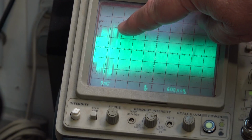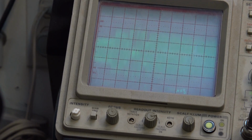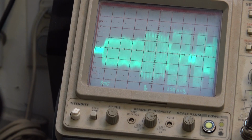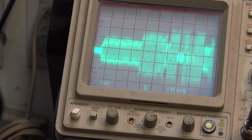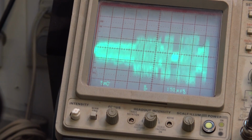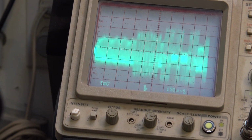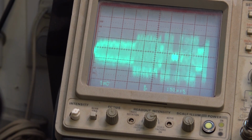But I can see the distinct bands here. These are the bits. If I expand it more, maybe that makes it a little easier to see. You can see here, this is actually the payload. You've got your auto track finding payload, which is used for the tracking servos, as well as any data bits, like where they would store the bits that determine whether it's a first generation or a second generation copy. That's your serial copy management bits.